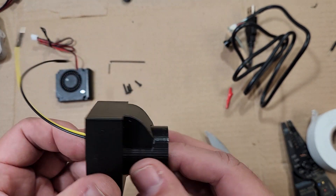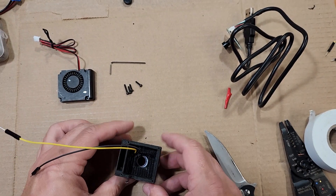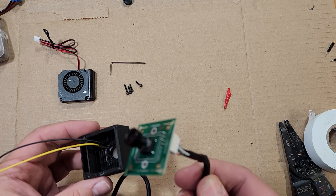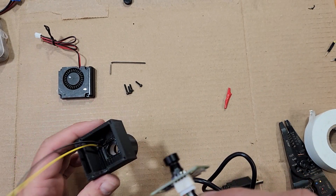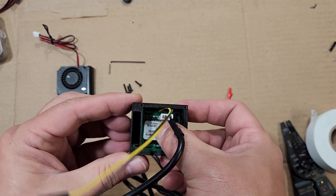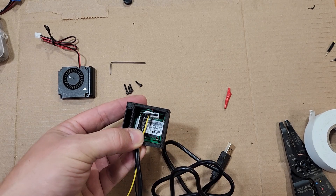The next thing we're going to do is push those wires down into the recess that's been made in the camera body. You can see there's a recess in the bottom and then a recess in the wall — that's going to allow us to run the wiring around our camera module. Before we put that camera module in, we want to make sure the connector is tight and all the wires are connected well, because it's a little bit of a pain to do that after. Take note of where the pins are on the camera, because these stick out and you need to orient the camera so those pins are in that recess where your wiring is. That wiring should just pop right around the camera, and then we'll pull it across the body into the notch at the top of the camera body — this allows all our wiring to come out the same side when we install the fan.